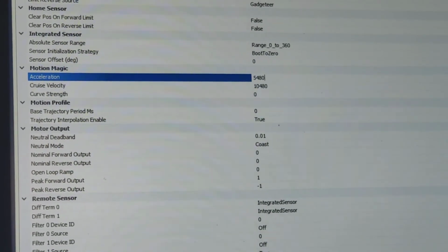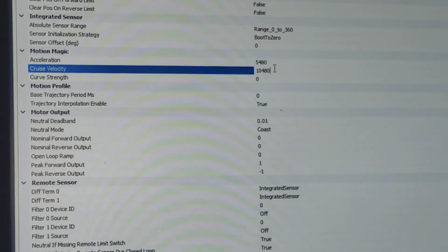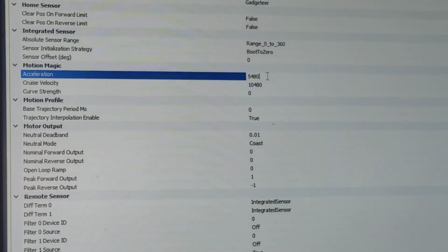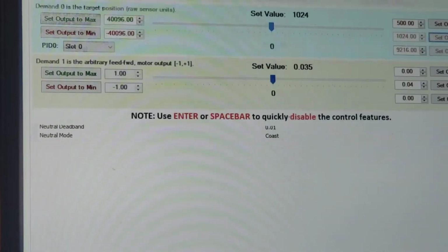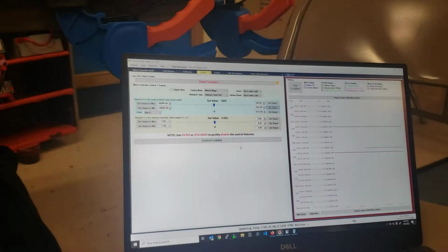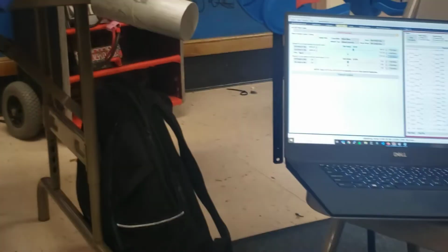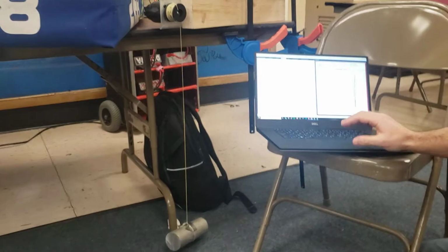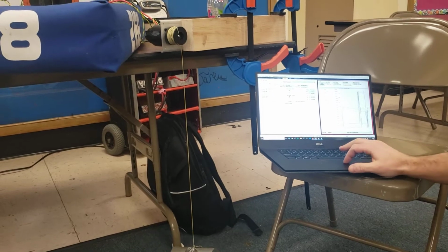It was slow acceleration up to a top speed, and we set the top speed to be 5 revolutions per second, with an acceleration that was something else. I don't remember. It was kind of fudged into a speed that was reasonable. So with all that set, I'm pretty sure that's all the parameters that we twiddled. We can command pretty aggressively to our destination positions, maintain a load, counteracting gravity, yeah, it works.